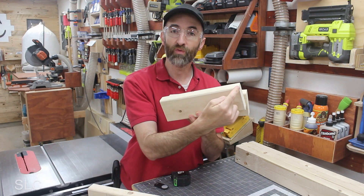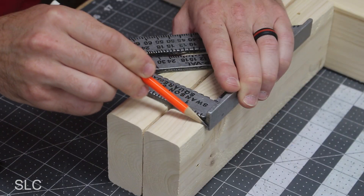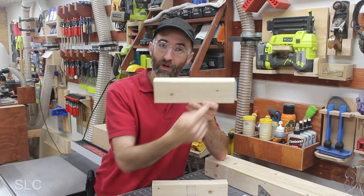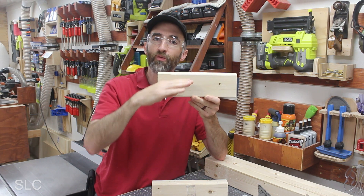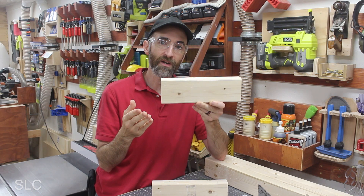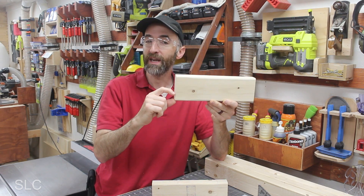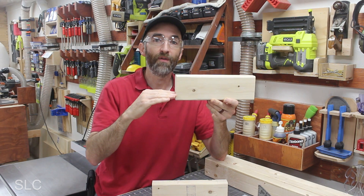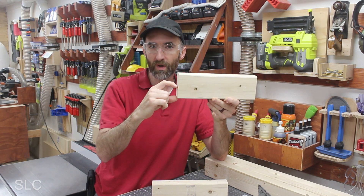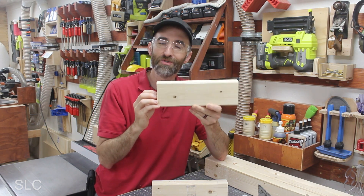First we need to measure roughly an inch and a half down and make a mark. I'm now going to make a reference mark from that one-and-a-half-inch mark all the way down to this corner, and that'll give me roughly a 20-degree angle for this footrest. If you don't want a 20-degree angle, there are a couple of ways to adjust this easily: going up one inch on the side gives you roughly 15 degrees, and going roughly halfway in the board — about one and three-quarters — gives you roughly 10 degrees. So choose wisely.